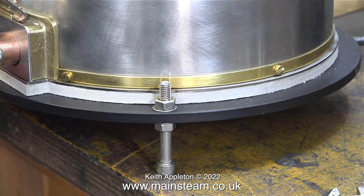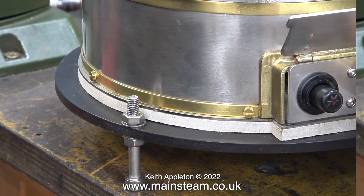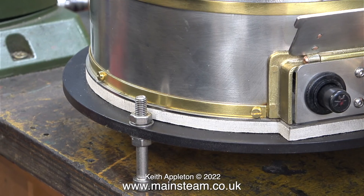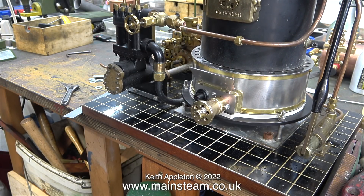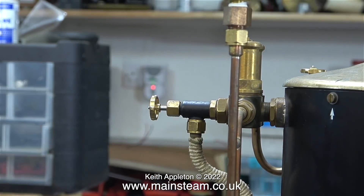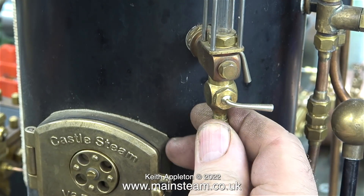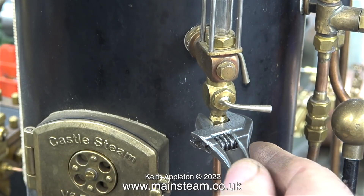I used three stainless bolts to elevate the position of the ashpan. I put a nut on each bolt with a washer, then fit another washer and nut on top, and once everything was tightened up the ashpan lifted the boiler to the correct position so I could put it all back together. I want the operation to be quick and simple — even though I like the convenience of gas firing I still want to be able to run it on coal, and changing the ashpans is very simple. All I have to do is remove four pipe unions, lift the boiler off the coal-fired ashpan, and place the gas-fired ashpan in position. I'm also tightening the union for the water gauge blowdown pipe, though I won't need to do this once I shorten the pipe.